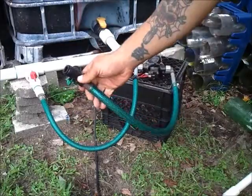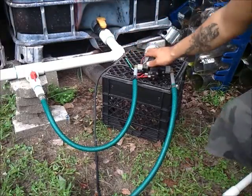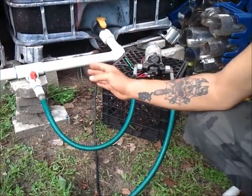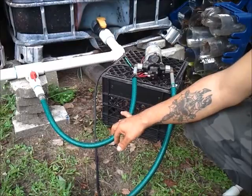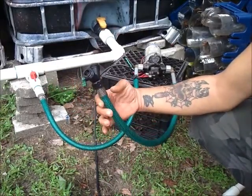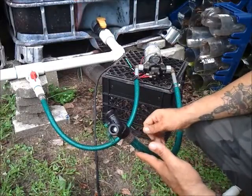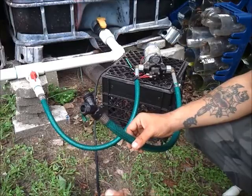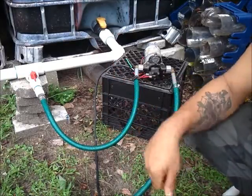When water's in a pinch - it's the basics for surviving, something we all need. Very simple, effective little pump using nothing more than an RV-style pump and rainwater collection. You don't even need the head pressure from tanks - you could fabricate a strainer that fits right onto that fitting with a full-size garden hose, keep the pump near a stream or pond, and use the strainer to protect the pump from debris. Hook another garden hose up and your water supply is practically unlimited with a good water source. Please rate, comment, subscribe, and thumbs up if you enjoyed this demonstration!